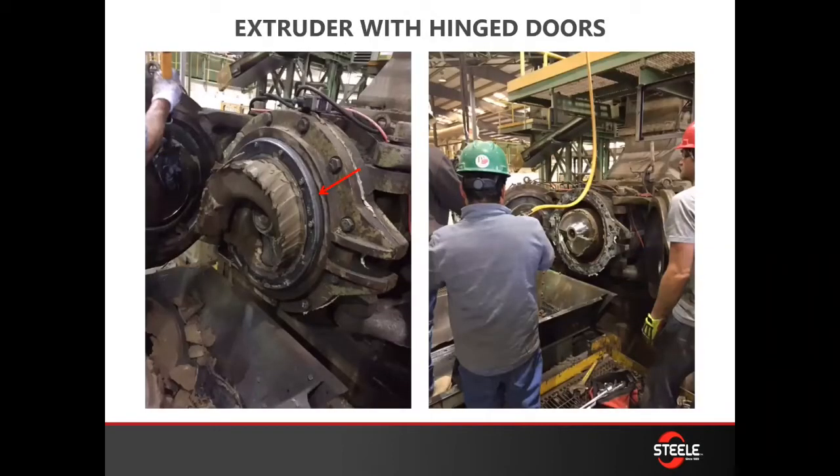If you have a hinge door, first remove the shear bolt and swing the doors back out of the way. Next you'll need to remove the front barrel adapters and clamp ring that holds the L10 liner. Make sure to have a replacement gasket or sealer on hand when you replace the adapter, because you need to seal this off.